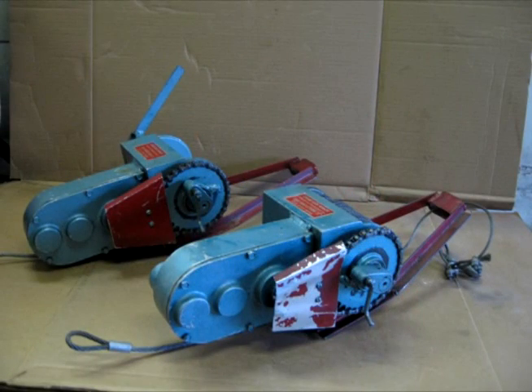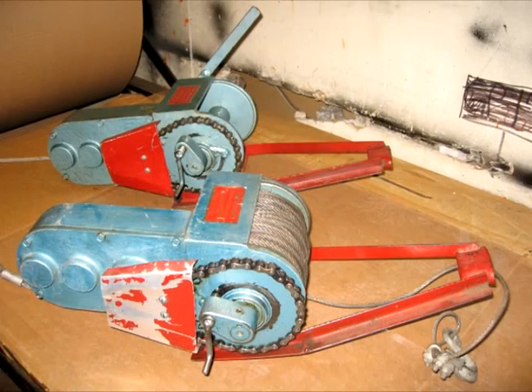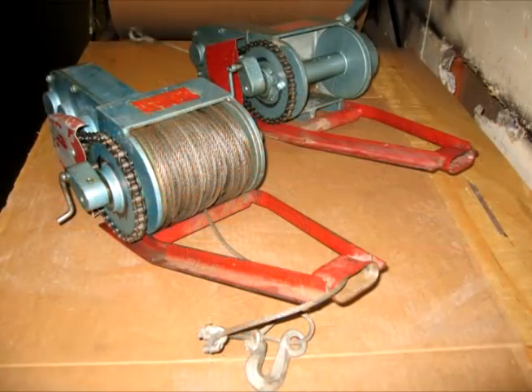This is the next evolution of the Lewis Winch. These ones are very similar to what you see today. Again, you'll see the brake handle is exactly the same. The fair lead is much narrower — we've widened the fair lead out now so it's the full width of the spool, making it easy to wind the cable on nice and even. And on this model, you can see the crank on the clutch handle, so the clutch screwed into a hole in the sprocket. That has changed a lot over the years.